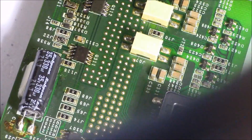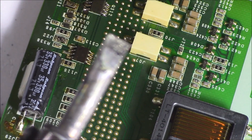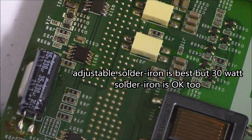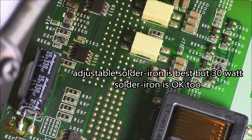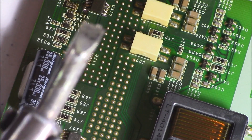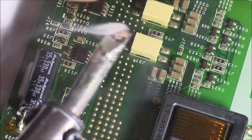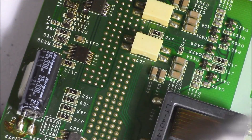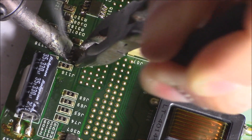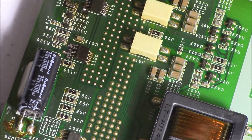What we want to do is take your 40-watt soldering iron. Make sure you have a flat tip like this one, and clean it with a wet sponge. Right here I have my solder — I'm going to tin it. When you tin it, you should get just a little bit of solder at the tip, just like that, and it should lift right up.